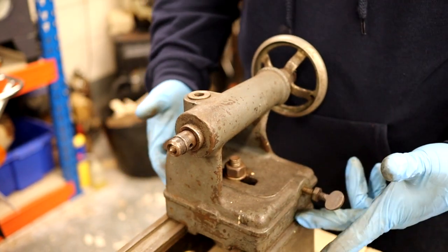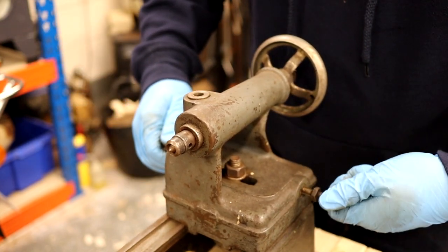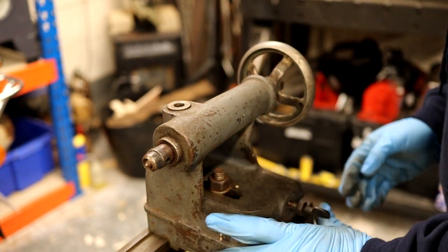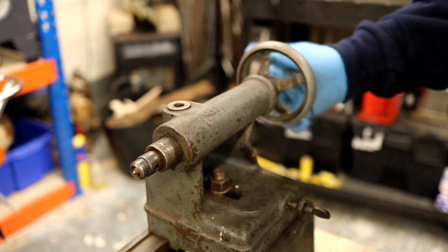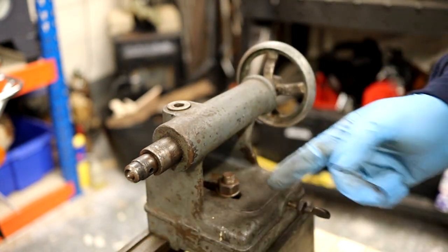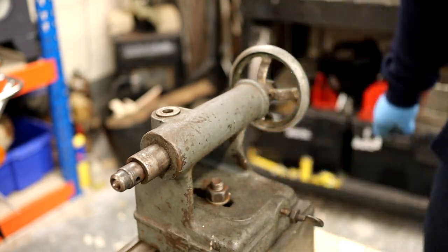When I first saw this I thought it would be a dovetail with gibs on the side, but it's actually for aligning the tailstock left and right, which I think is absolutely amazing. You can adjust these and lock them off — it's pretty amazing that they've kept in shape all these years. I've got a quick speed adjust winder missing but I can easily machine one. There's also a saddle lock that currently requires a spanner — I may be able to modify an adjustable lock nut.